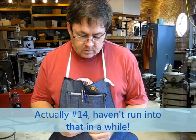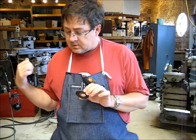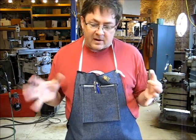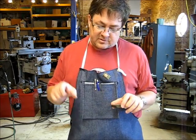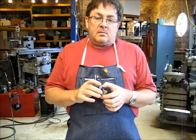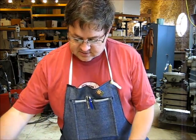So we're going to drill the holes here on the mill. I'm going to demonstrate using the bolt hole pattern functionality of my DRO. I have the usual Sino DRO. Got mine from Shars. They're sold through several manufacturers. The documentation tends to be somewhat of a challenge, but if you figure it out, it's a really useful piece of equipment. So anyway, I'm going to use the bolt hole pattern section to cut some sight glasses.